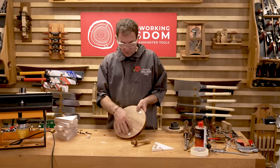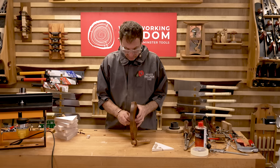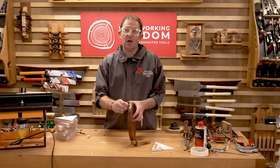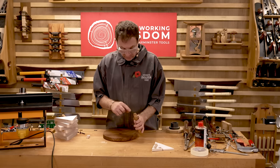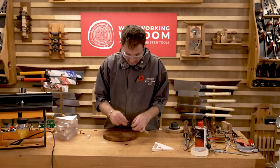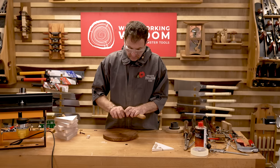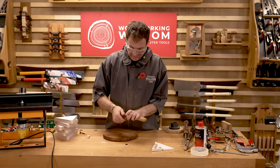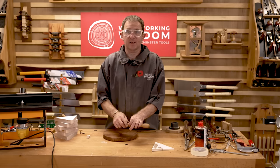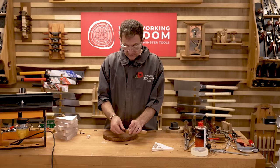So we've got our three feet, now to bolt together. I can measure through the board, so I know I've only got half inch thickness. I've then got the threaded stud, so I've got a start to look at. So I've just cut my bolt down in length a bit. Let's just check I can start it in there before. That'd be good. I can bring it up to within half inch of there. Fantastic. So by cutting the bolt down, this is the only stage I can do it. I know that it's not too long now. It's not going to bottom out.